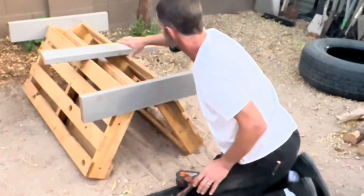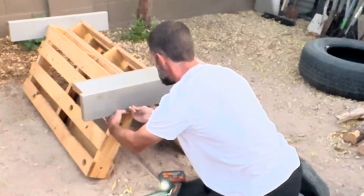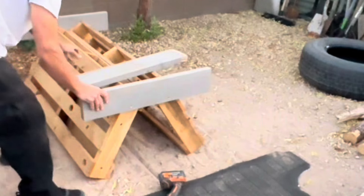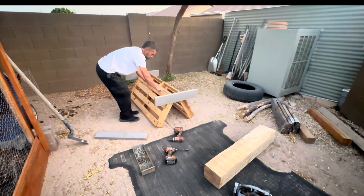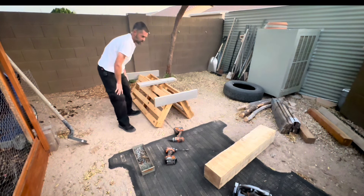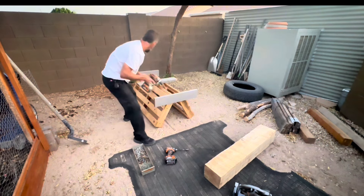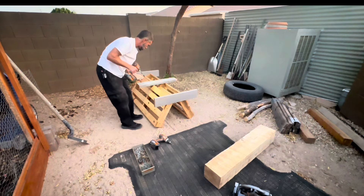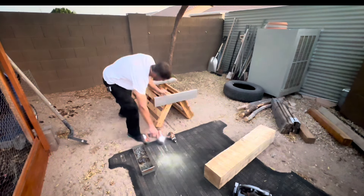So when I put one across here you'll see — just pre-drill them so it doesn't crack the wood, helps out a lot. There we go, that's good. So now I've got my stance, now it's good. You can see I got that set up pretty sturdy. Possibly put one on the bottom here. This pine is going to stick off a little bit — I'll be screwing them in using three-inch screws here.